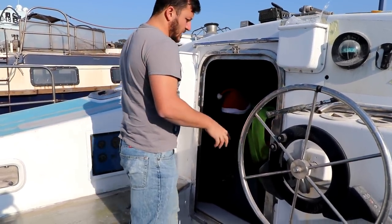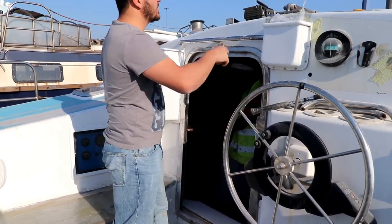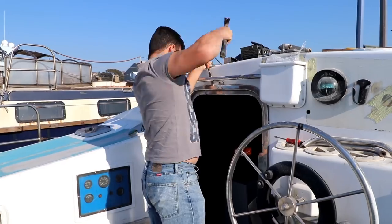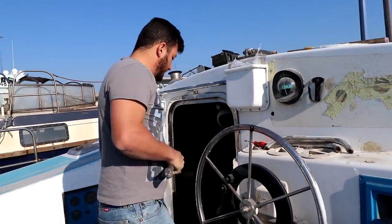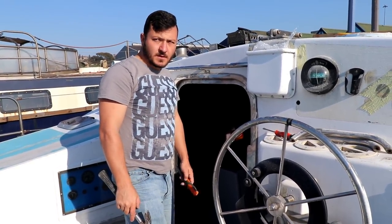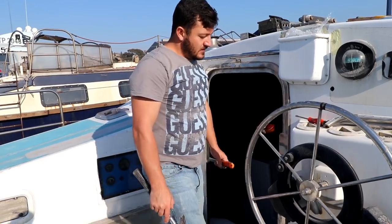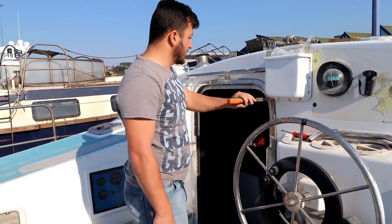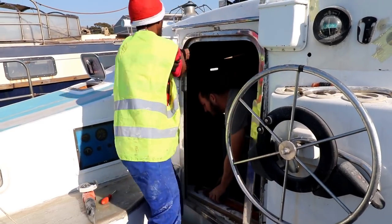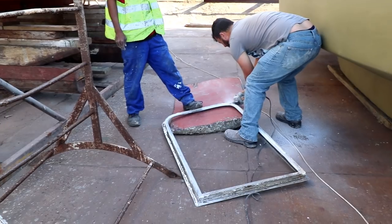We're putting a swing door. At a later stage once the boat's done, I'll put a seal around it completely and then two lever-type mechanisms — similar to the hatches — that you can open and close from inside and outside with a locking mechanism. One thing I always say is when I put things in, I hope I'm not the guy who has to take them out. Why did you put it in so solidly if you knew you were going to take it out? At a stage I thought we might leave the old door in. It's been Sika flexed right around and on the inside it's been filleted with epoxy.